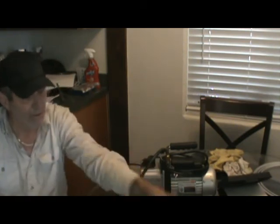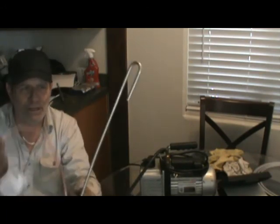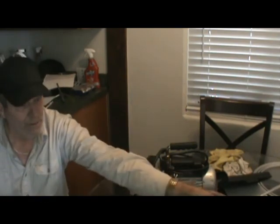That's where you melt the aluminum joint. Because you keep putting heat on that joint farther down to get the solder, the heat exchanger soldered into the copper, but it's not clean. And you end up melting the aluminum joint, the aluminum weld. Okay? Now you're screwed. But now you're not, because there's a product, and look through my channels and you'll see it, for repairing the aluminum weld. So, got you covered all the way around.